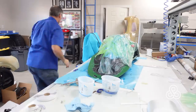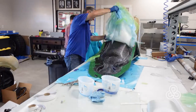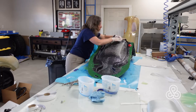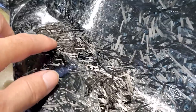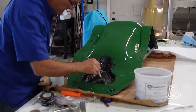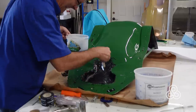I decided to take the two layers of fiberglass cloth off as well, and with everything out of the way I had enough time to mix up a batch of fresh resin, get a brush and squeegee, and try to sweep it in and press it into the area that was starved of resin in the infusion. But it was a fail — you can see the dry fibers that just didn't get resin in a couple of areas. So we're going to start over and go to the tried and true method of wet layup. To keep the fibers from just sliding out of the mold this time...